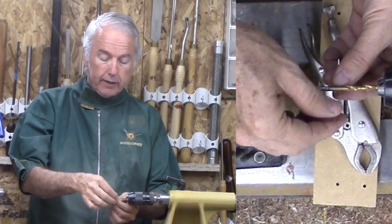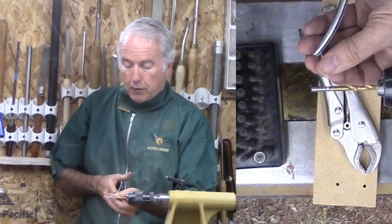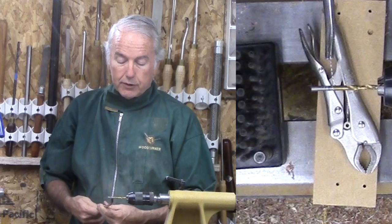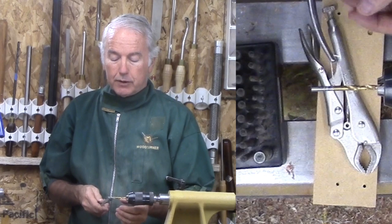Take your wire and wrap it around the shape. Put the two ends together again. Grab the two ends at the same time. Then it's actually a simple matter of twisting it, somewhat like a rope. I like to give it a good, heavy twist where there's not much of a valley between the strands. I think that will just about do it.